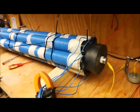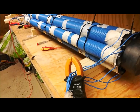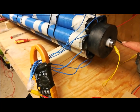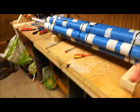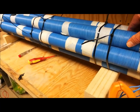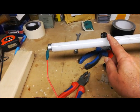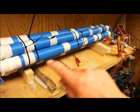So what we've got here today, if you can see this, we've got six coils wrapped around steel scaffold tubes — one, two, three, four, five, six. And then we've got a centre scaffold tube with no windings around it, but with a fluorescent tube through it. The length is about a metre long. These coils are wound with just lighting wire, 1.5mm copper plastic-coated wire.